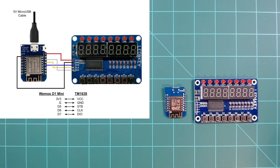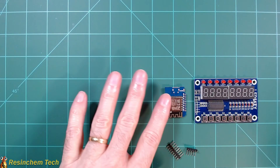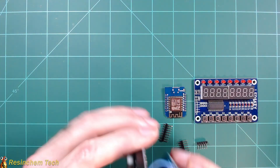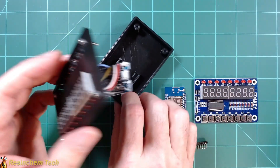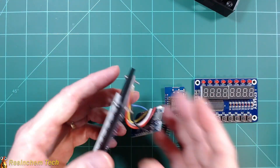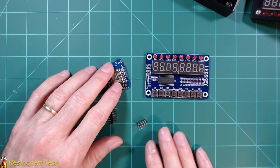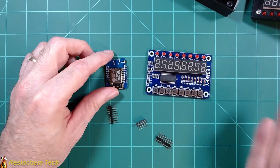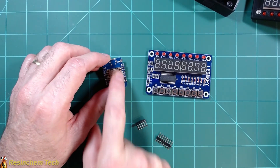The whole thing is powered by a 5V micro USB cable. I did hook this up to 5V and it didn't immediately fry my Wemos D1 Mini, but to be safe I'm using 3.3V. You can use pin headers with Dupont jumpers, or solder directly through the holes of both boards. I opted to solder directly because I plan on putting mine in a 3D printed enclosure, which let me make it a little bit smaller. For initial testing I did use pin headers and Dupont jumpers.